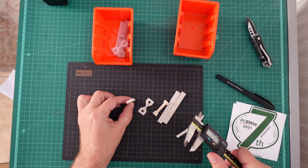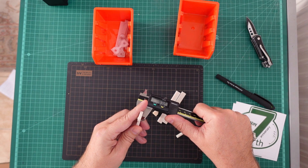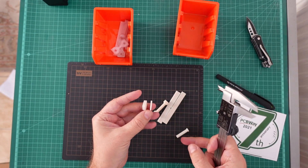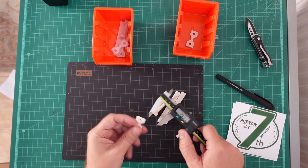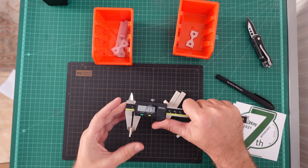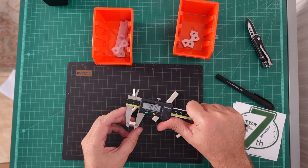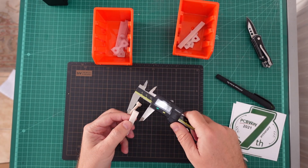These resin specimens are printed in vertical position and this should be 4 x 4 mm — that's very close. There is something wrong with this part; the thickness should be equal. Apparently this was printed in horizontal position and this is 4 mm but this is 2.7 mm — it should be 4 mm. For bending, okay that's okay, 4 mm yes, that's okay. For impact test, okay.